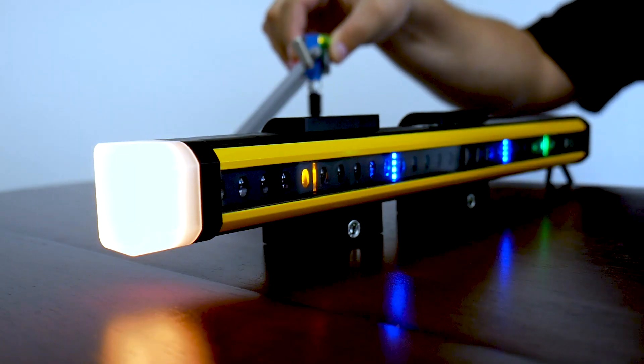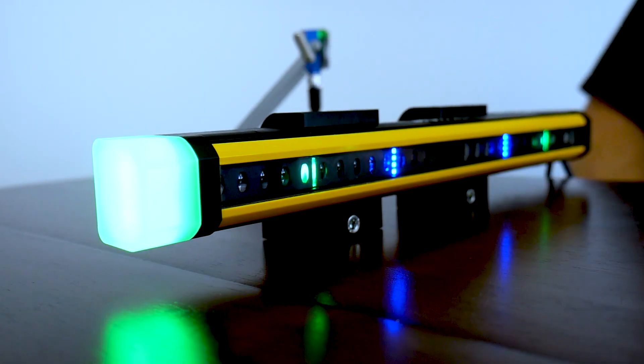You can see the stack light went yellow, meaning something is about to come through. I pass my box through, let go of my muting sensors, and I come back to green. And you can see my status still indicates that I have perfect alignment.